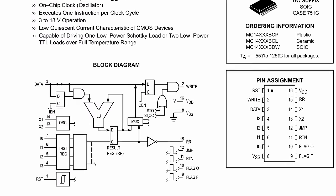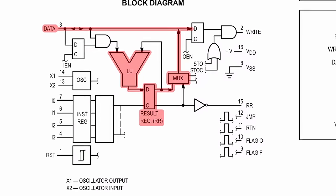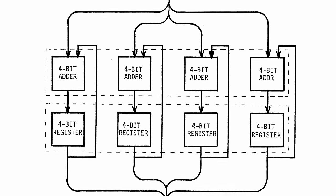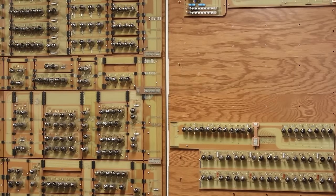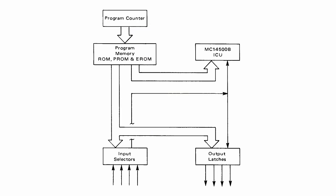It has a really fascinating architecture. It has a proper logic unit, an accumulating result register, a one-bit data bus, and all sorts of other really interesting things. But it's not a bit-slice processor, meaning you can't stack multiple of them up in parallel to get an eight-bit computer. So that's what the UE1 is — we essentially built the MC14500 out of vacuum tubes, but we did make a couple of modifications: we added a proper arithmetic logic unit and a carry register so it can do addition and subtraction now.